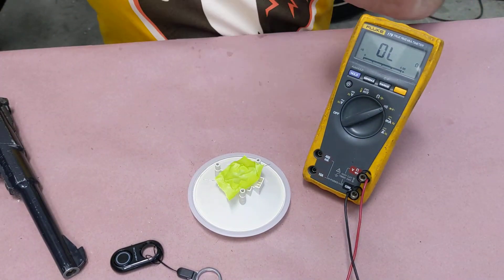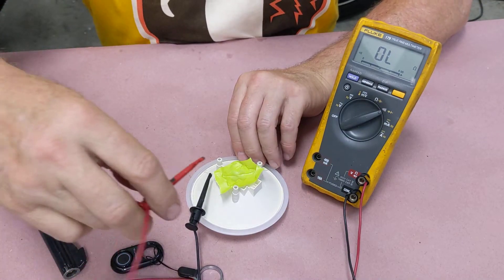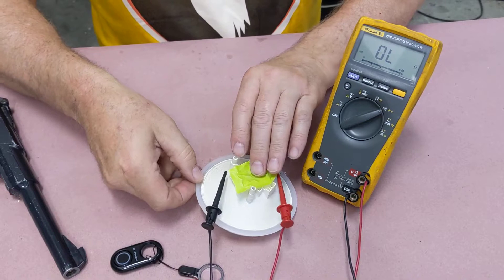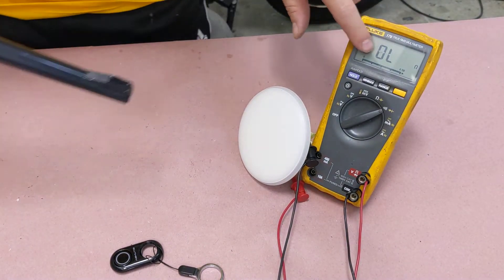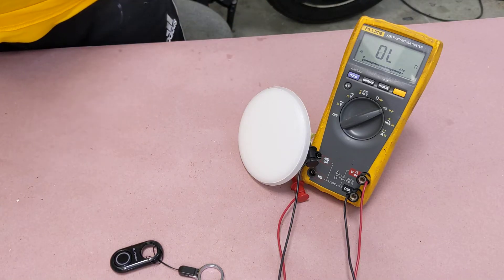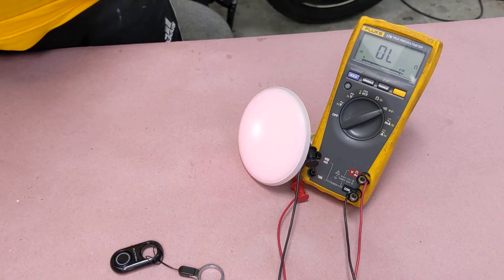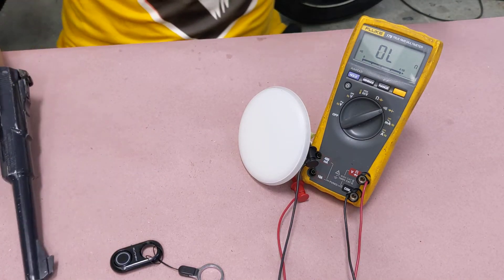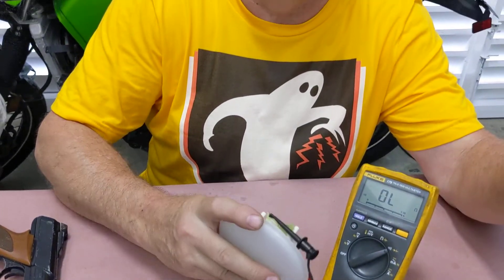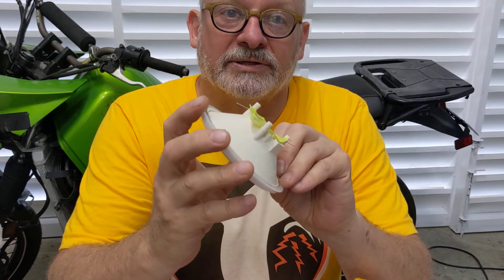I'll tape the sensor in here. I've got a voltmeter set to measure conductance — that's pretty much how I would be using the circuit — to trigger an optical isolator system. I'm going to strike it with the laser. Right now it's indicating an open-lead condition. I'll step back and hit it with the laser, and sure enough it's able to discern it easily — it goes from open-lead down to around four to six hundred ohms. That's a really good result, and I'm pretty well convinced I'm going to be able to develop a circuit that uses this sensor and diffuser cone assembly. I think it's going to work pretty cool.